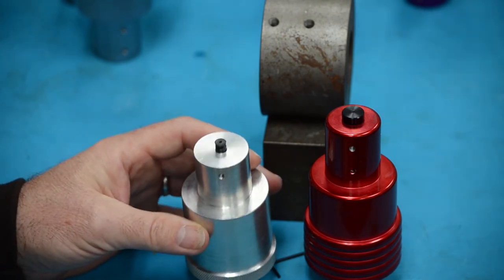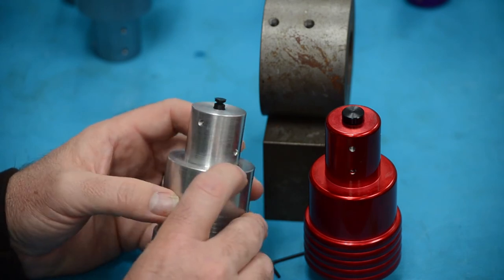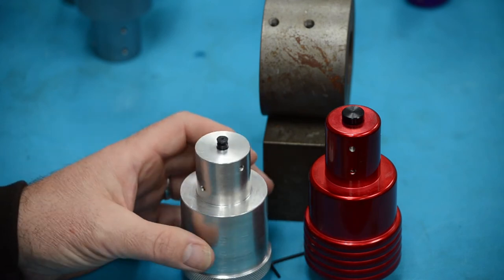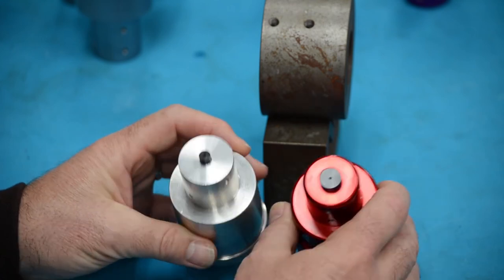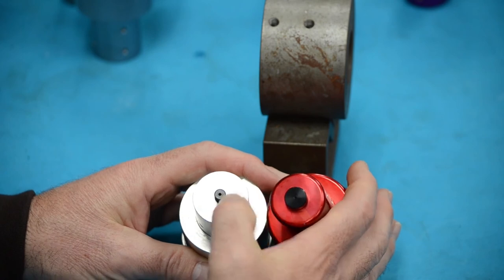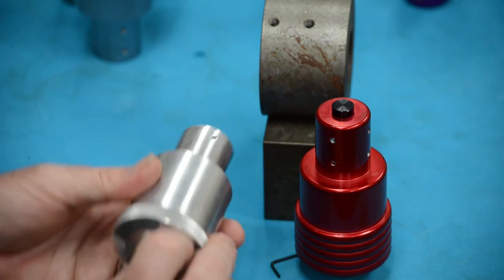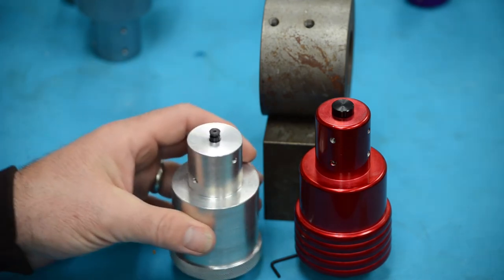Some of the cheaper lasers are not tightened down as well, and some of them may only have 3 holes. And you can tell with 3 holes, it's still going to allow it to wiggle around. So some of those cheap lasers come out of collimation quite easily. The other reason I prefer the Farpoint laser is that the aperture here is smaller than it is on the Howie Glatter laser. I think Howie's changed it, but his are still bigger. They both work fine, but I get a little bit finer beam out of the Farpoint laser.